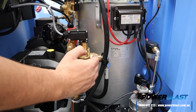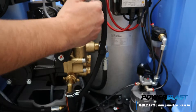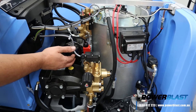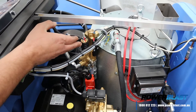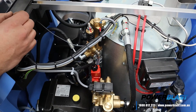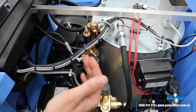So we've got our water coming out the top of the pump head here under pressure, through that rubber connecting hose up through here. We've got a dampener on there to avoid any cavitation or jarring in the process. Through the safety block here, which is secondary to the unloader — this is set 10% higher than the unloader. So if anything was to go amiss internally in the machine, it will dump the water straight back into the tank and bypass.